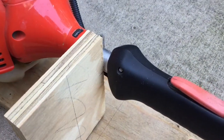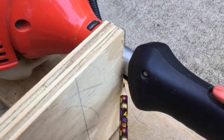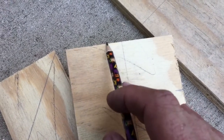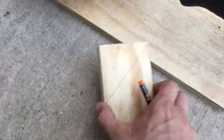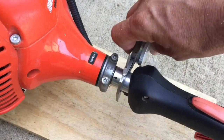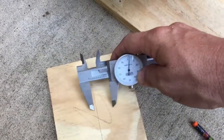I took this piece and marked the back of that tube — you can see that line right there. So I'm gonna come just a little bit inside of that, make a mark, and cut a groove out of the front of this the width of that tube. This is my 45-degree brace. I came in with a pair of calipers to get my width and I'm gonna use that measurement to mark the distance here.